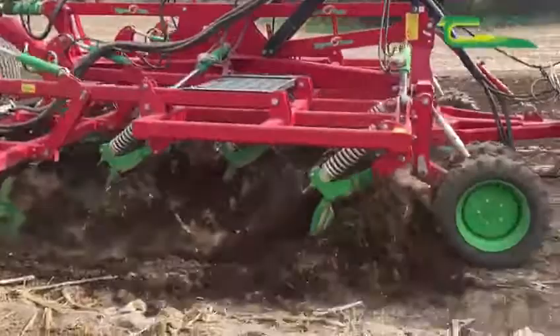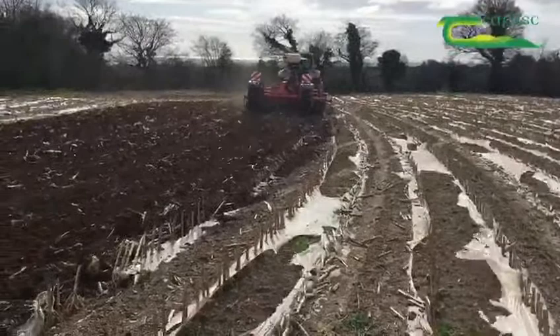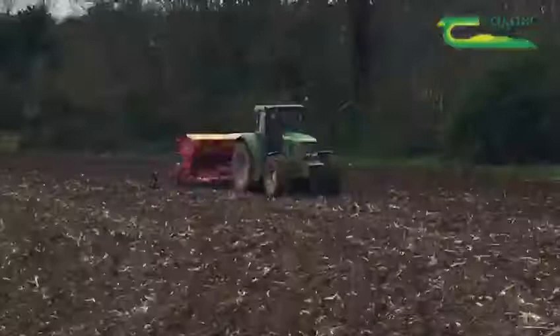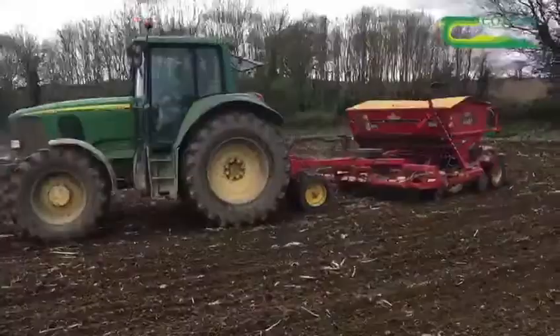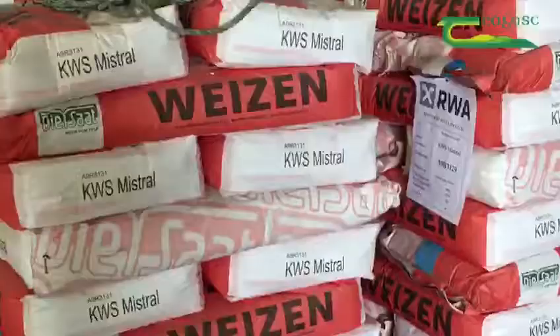This spring he has sown the majority of his crops by min-till. His stubble from last year's crop was cultivated with a 3.6 metre Agro-Tom tined cultivator with discs and a packer roller on the back. This was followed by a Väderstad Rapid drill, which sowed the crop at a seed rate of approximately 155 kilograms per hectare, or 10 stone per acre.